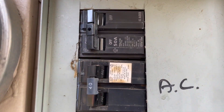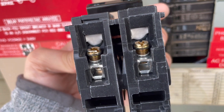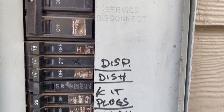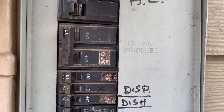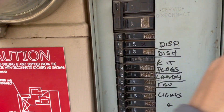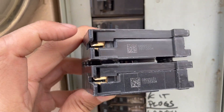Once you pull the wire through, your 50-amp breaker has two slots — you undo the screws and put the red and black wiring in. The third wire is the ground wire. Inside the panel there's a silver bar where all the copper wires are attached — that's the ground bus bar and that's where you attach your ground wire. To install the breaker, you hook it in on one side and press it in; there are metal tabs inside that the breaker connects to.